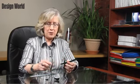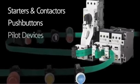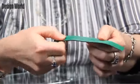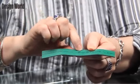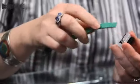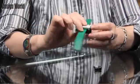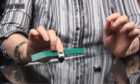You connect components such as motor starters, contactors, push buttons, pilot devices, selector switches, control relays, and I/O modules. Connection is very simple. You have a black line right here on this one end, and you also have some arrows marked on the cable that show you where to go. So you can either slide in these connector devices, or you can place them on top and then crimp them in order to make the connection.